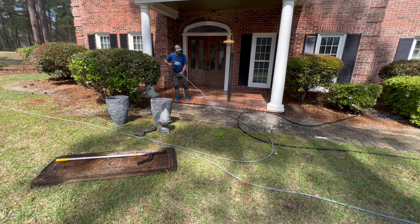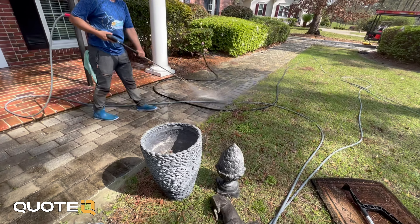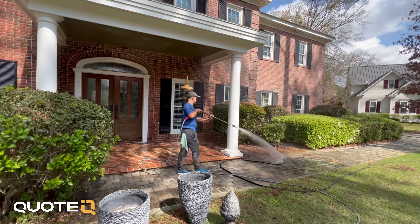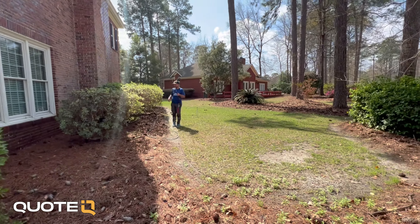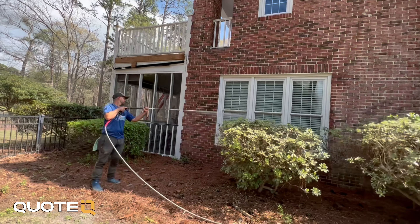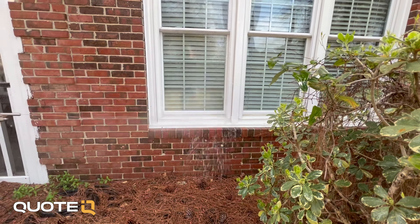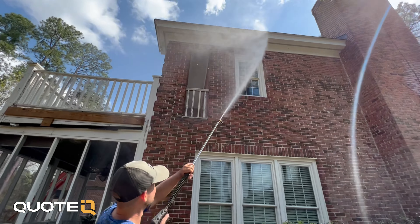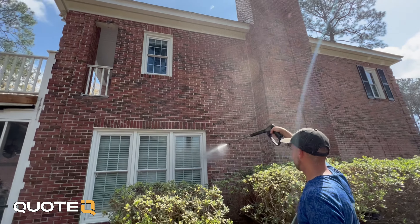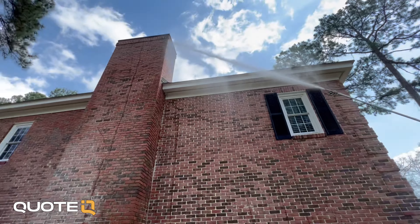So the question is: do I need a buffer tank, and if so, how big should it be? We'll first talk about why you need a tank and what determines whether you need one or not. When you pull up to a customer's house, you're going to find the water source — you'll need that whether you're running a tank or not. Typically, an outside hose faucet supplied by a local municipality provides about six to eight gallons per minute. This assumes that other faucets are also open and being used inside the house, so there can be fluctuations depending on toilets being flushed, someone taking a shower, the dishwasher, or the washing machine. But on average, between six and eight gallons per minute is what we get.